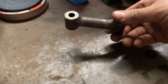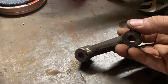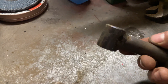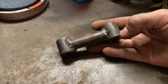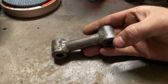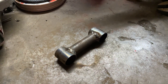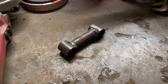Okay so this is the first mount done. It's basically just like a little dog bone setup. You can see it's plated on the end — welded it up, ground them down, put a bit of a chamfer on the end, and then welded the 20mm tube in between the two. Came up all right I think. Looks a lot nicer than using flat plate, square bar and right angles — it's just a bit nicer using the round tube. I'll knock another one up and then we'll get to measuring up the centre of the strut brace.